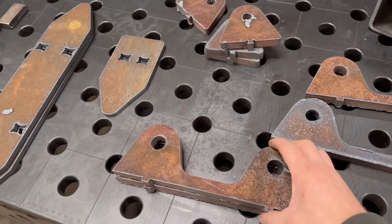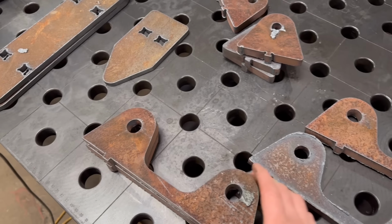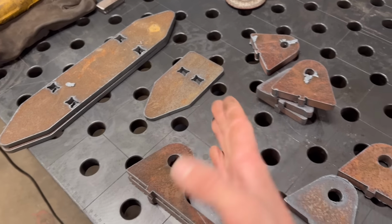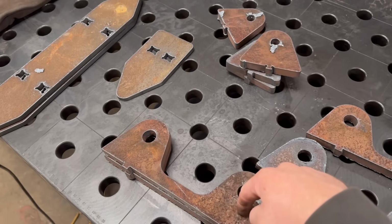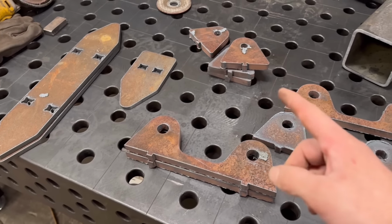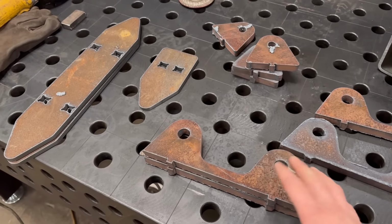And then I couldn't decide whether to ream them through now, just tack them together like that, or weld them up onto the plates and then fasten a plate on its side and ream them through. I think I'll do that. I'll weld them on first and then ream them through, and then I know that the weld hasn't pulled them out of line.